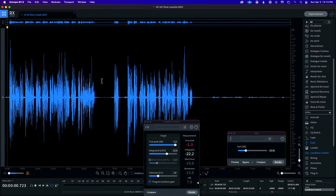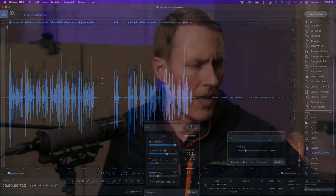So on the Zoom F3, let's go back to our main cam here. On the Zoom F3 that we looked at last week, there is no gain setting. You do not have any control whatsoever over the gain setting. But on the F8n Pro, you do. And what's interesting to me about that, and that was actually the similar approach that Sound Devices took with their MixPre II series when they introduced 32-bit float, you still have gain control over the analog preamplifier. And what that means is you can actually tune the sound that you're capturing, which is really interesting.